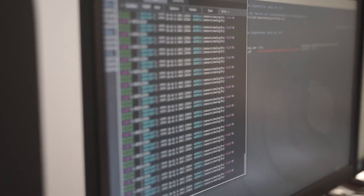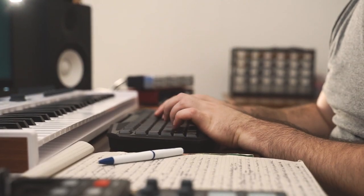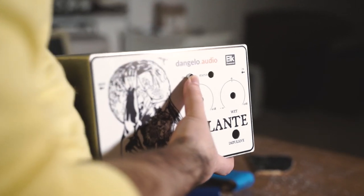Finally, I configured Linux to run Sushi, Sensei, and the Glue application at boot, and set the mounting of partitions as read-only, in order to avoid SD card corruption when, for example, pulling out the plug suddenly. This might seem like a lot, but I've done all of this in a few evenings and I really enjoyed the process. I really liked the results, but in order to make the whole thing like a real product, I also needed to make a pedal enclosure around it.